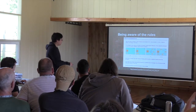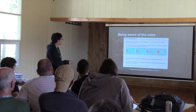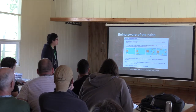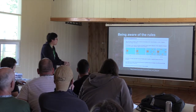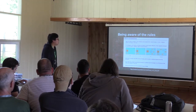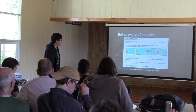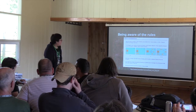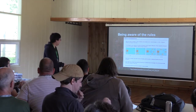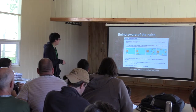Even something like JTAG has a finite distance that it can run, less than 5 inches. On a bigger board, that could reduce your time in trying to find where the JTAG port is, because that's a signal that runs around 20 megahertz. If you don't lay that out properly, that signal probably wouldn't make it to the connector at 20 megahertz. Yes, your traces become low pass filters.